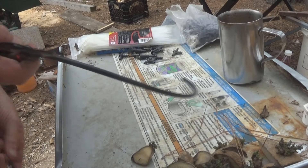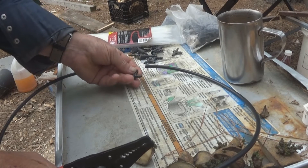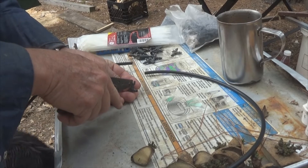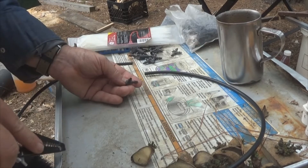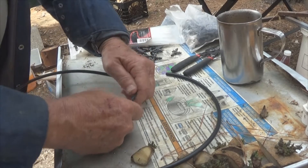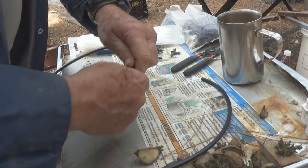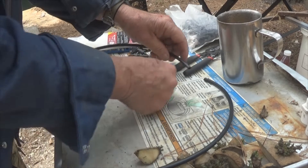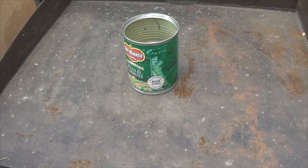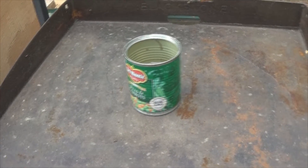The first thing I want to do is put this together using a T-connector. This T-connector is going to be where the incoming line feeds into this loop. If you take this and shove it in there, it takes some force — it's hard. I'll show you an easy way to do that. To make it easier to thread the tubing onto the T-section, I heat some water up to boiling.